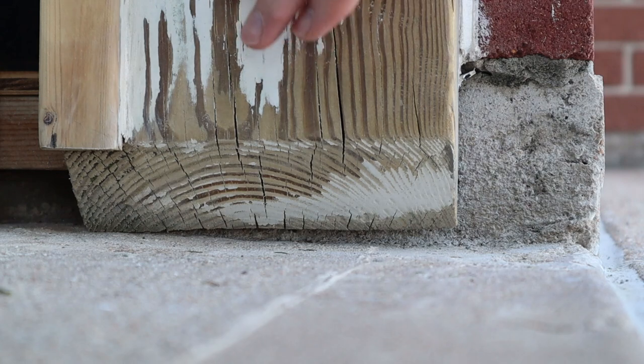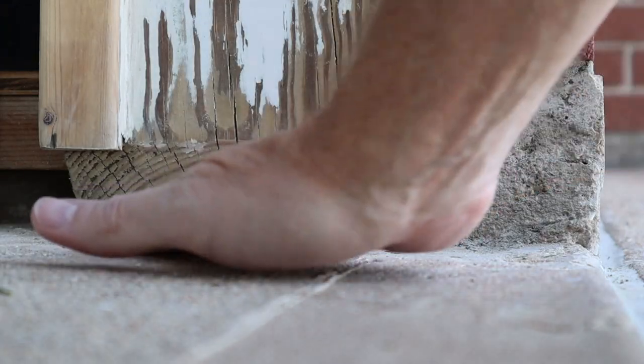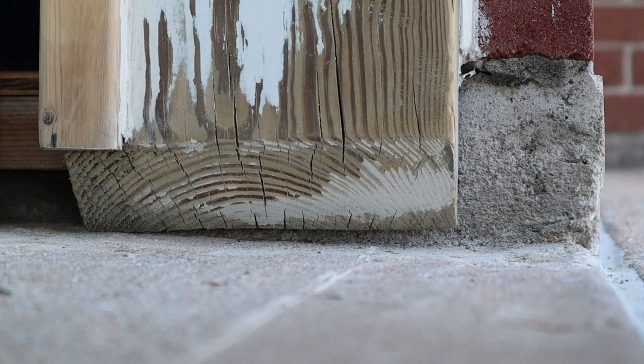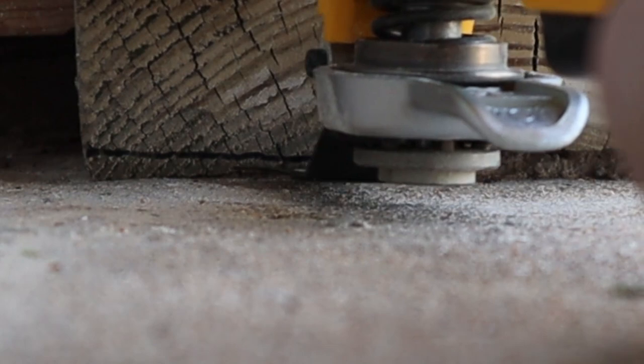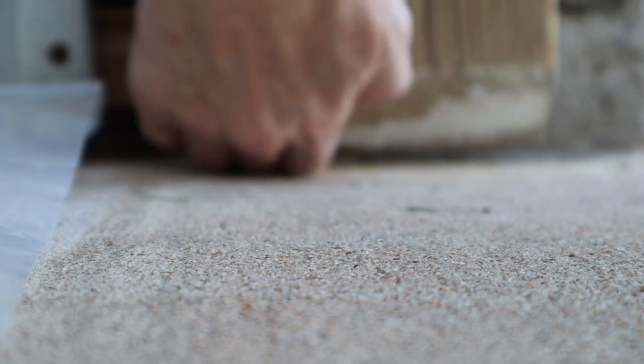While this is pressure treated wood and it's good for ground contact, I want that open so water can drain and this thing doesn't wick any water up. I'll make a little line where I need to cut and we'll cut that off. There it is — all done. Cut a little piece right here. Nice and pretty. Now when water gets there, it'll run out from under there and I ain't got to worry about it.